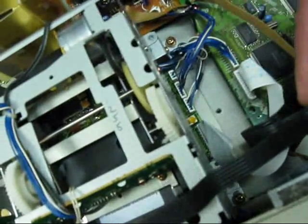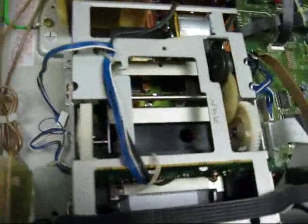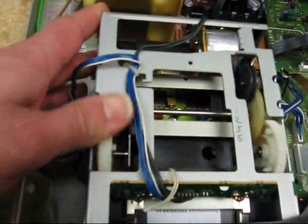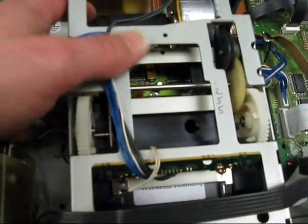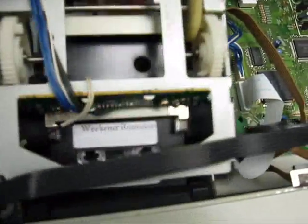The Panasonic 4100 also has a flexible ribbon cable that goes across here — only the 4100 has that; the other ones don't. So what we do is carefully rock this back and forth a couple of times to pull a little tension off the tape, then gently pull out the tape transport, push it forward just a little bit to disengage it, and lift it out like that.